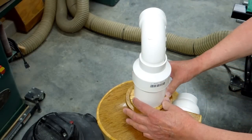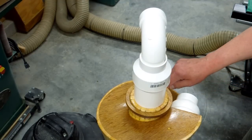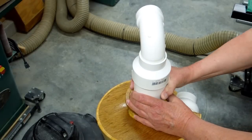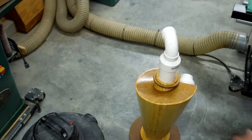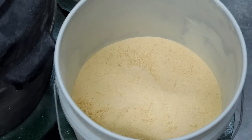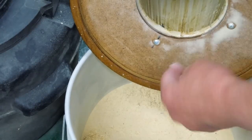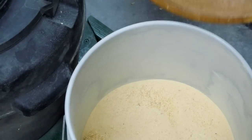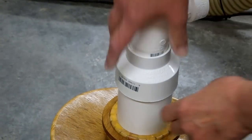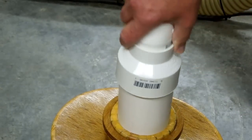When this is running, we may have to put a piece of tape on here to keep this from going down. When you interrupt the suction on this, you put a strong vacuum on this cyclone. Differential pressure will suck this pipe downwards, and I don't want that at the moment. I can see that material has been rotated slightly in the bucket — it's coming up on the sides a little bit. The bottom portion of the cyclone is a little bit dusty, but it hasn't gone up inside of it. There's no indication of dust on the inside of this pipe, so that'll probably be okay.